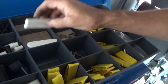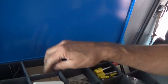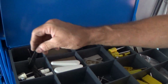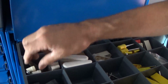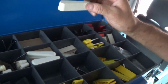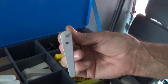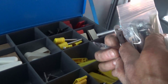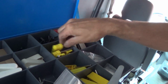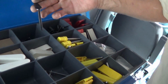Gottlieb's. Oh, yeah, Gottlieb's. Gottlieb shells for System 80s and System 1s. And then this is System 3s. They break once in a while. The welded shaft assembly. These are Bally welded shafts. These are the shells for Bally's here. They're different in Gottlieb. They're flat across. So you got the black Bally's. Yeah. And then these are early Williams and Stern. These are Stern. I have early Williams in here as well. Early Williams were changeable. They weren't always molded on the shaft, and that's what... That's for what? That's a Sea Witch? Would Sea Witch take that? Right. I have short ones.